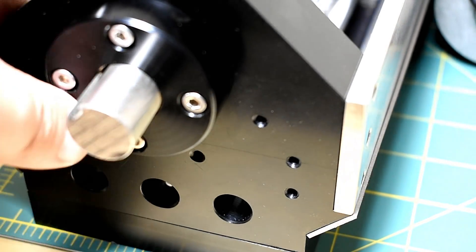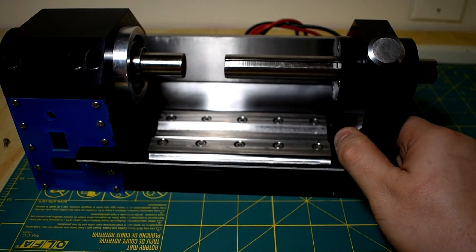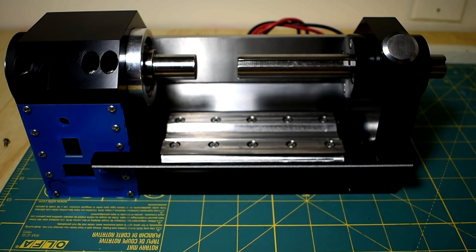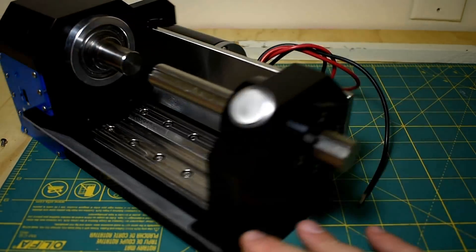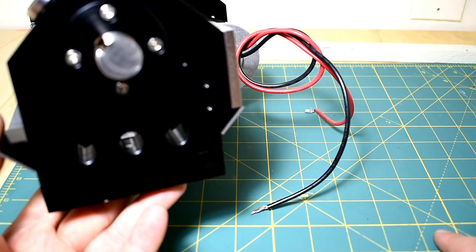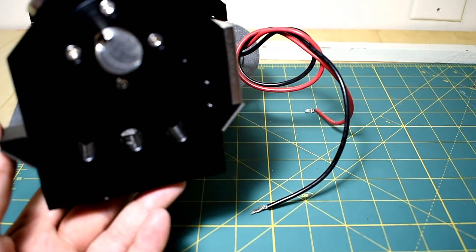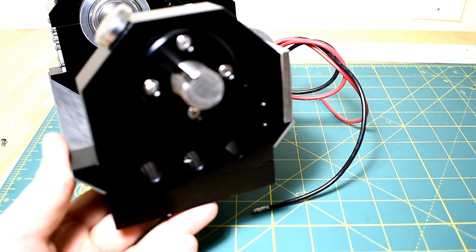A lot of people have been interested in this project, following on Patreon and seeing the plans as they come out. Many seem interested in using it as a more conventional lathe or even a CNC lathe. So I'm going to try to make it adaptable. In my design I'll have a bushing in here with a pusher rod along the carriage, but it would be fairly easy to include a design for a bracket and motor or coupling so you could go straight to CNC without having to retrofit it yourself.